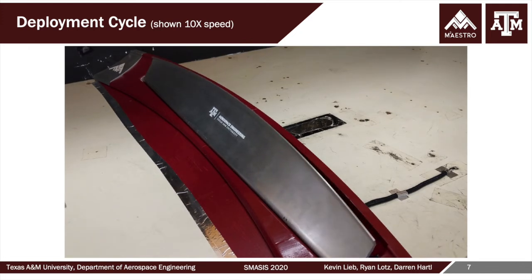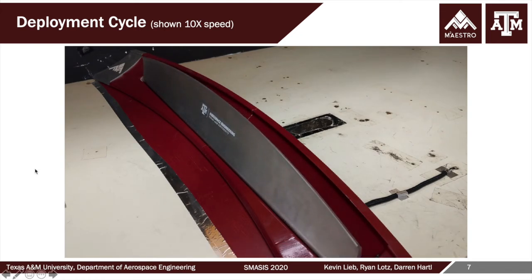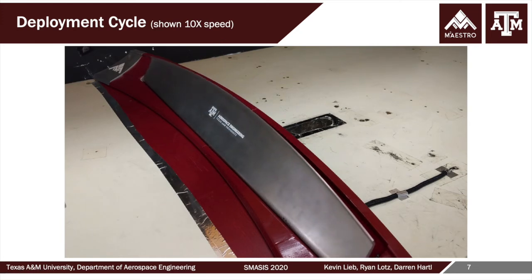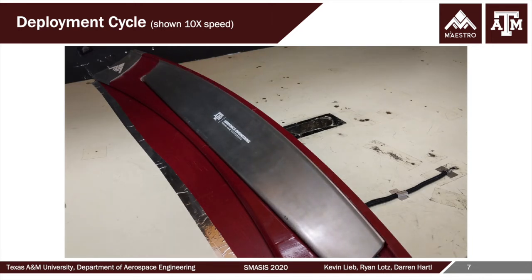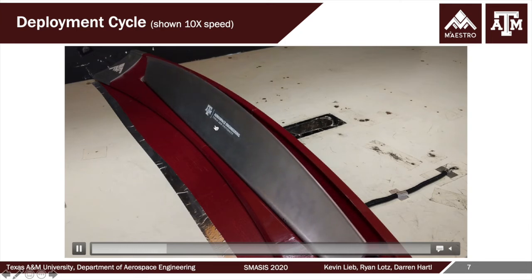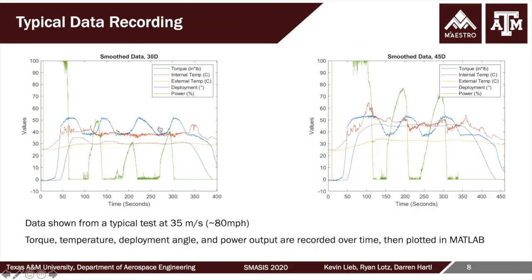It's easier to heat a metal than to cool it, and that's obvious for those that have worked with SMAs or gotten metal hot at all. But this gives you an idea. Obviously, the actuation is incredibly smooth, and this also lets you see how the aluminum deployable portion of the flow disruptor is embedded into and lays into this 3D printed static portion.